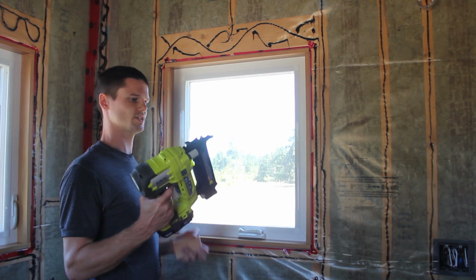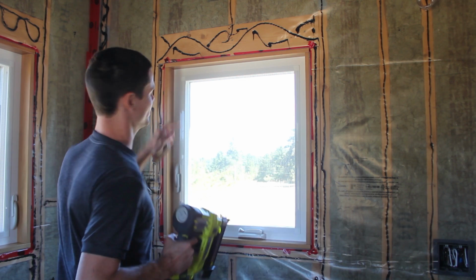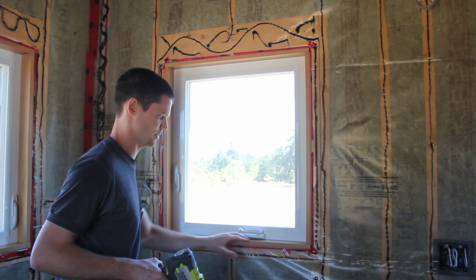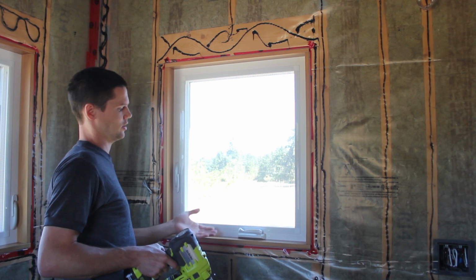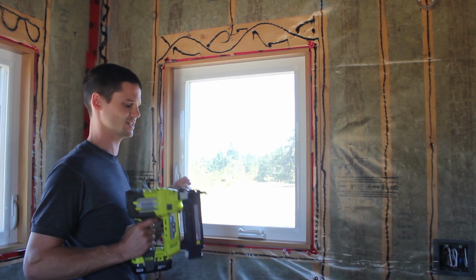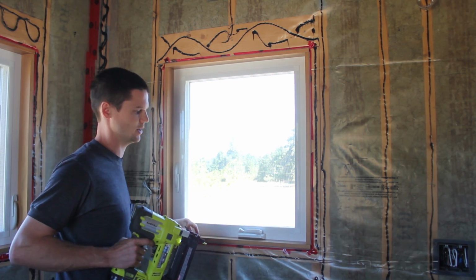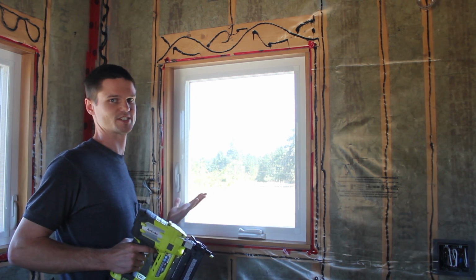If I didn't mention it, they're just 1.25" brad nails, sill finishing nails. And I've got the depth set such that there's always a little bit of variation just based on the spot on the wood that you're going through. So I've got it to err on the side of driving it just short rather than overdriving it, because if I drive too far, the driver will actually strike the wood and put a bit of a divot in it, and then you can't really fix that.